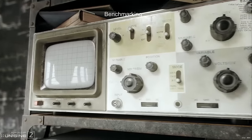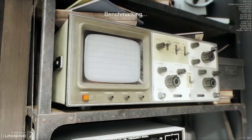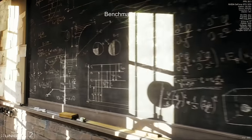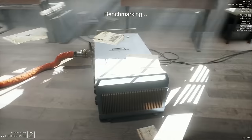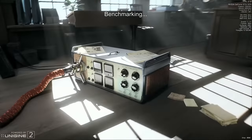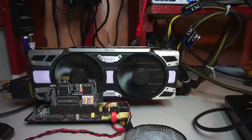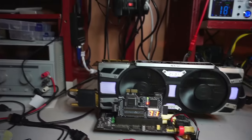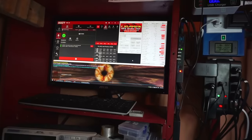The takeaway from this video is: if you're a miner, please regularly clean your rig or you'll end up with a broken card. And if you're really unlucky, the 12V short circuit that we had on this card could have killed your entire rig. So at the very least, make sure your power supply has built-in high current protection. And this is it, guys — if you take anything useful out of this video, please give me a like, post a comment below and subscribe for more, and I'll see you later. Goodbye.